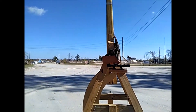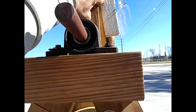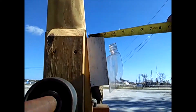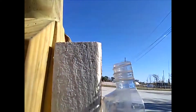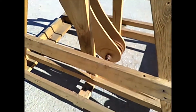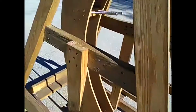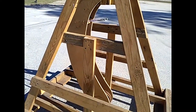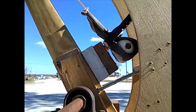I want to raise the cradle another inch, so I'm gonna do that. Two inches - let's take it up to three inches. The center line is four inches. We have about 50 pounds of counterweight plus the hanger, which I think is like another 15, so we're a little over 100 to 1 mass ratio. Let's take it up to three inches - I added this piece here, so that's about another inch and three-quarters.